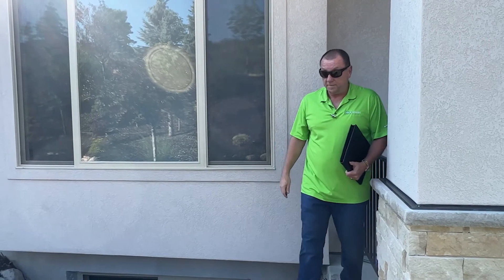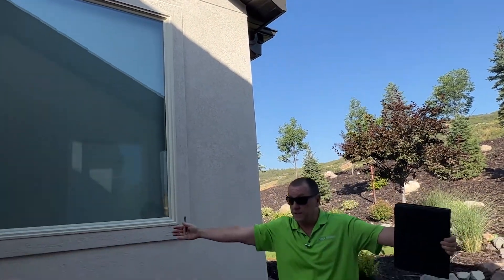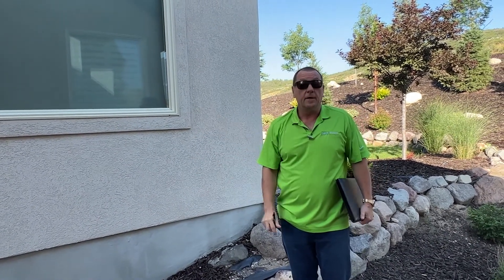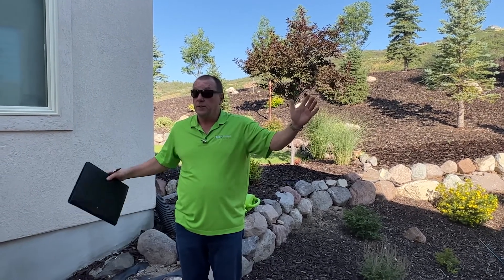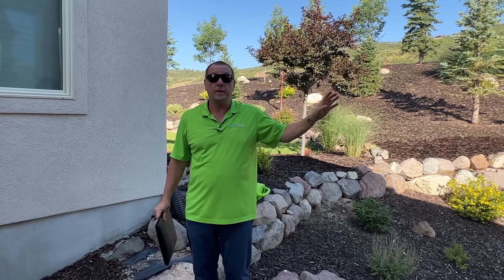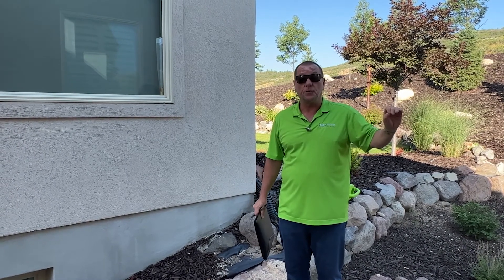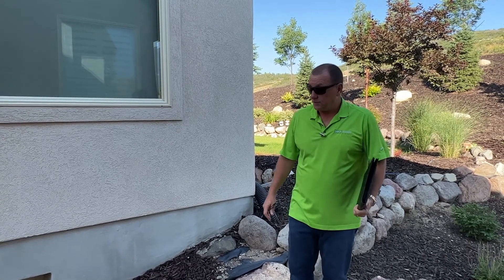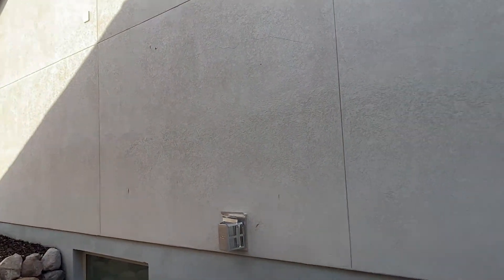All of the target points are under 60 feet, so I know I can use wide angle cameras on the entire perimeter. Now we're on the east side of the home — we've got two window wells that are a concern and this is really a blind spot in between the two homes. So we want to put a camera right on this corner covering this entire alleyway between the two homes. We do have one window very close to the camera that could go into the bedroom, so when we mount the camera we're going to go into programming and mask that window out — just a blank on the video. We'll even let the neighbor next door know that part is blanked out so there are no privacy issues. Now we have 100% of this home covered with wide angle cameras — a cost-effective design.